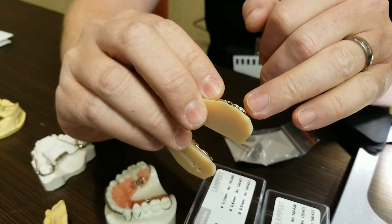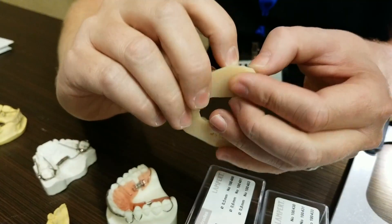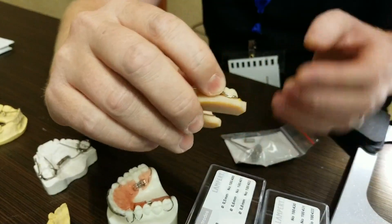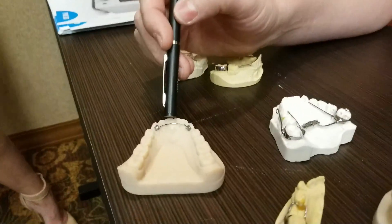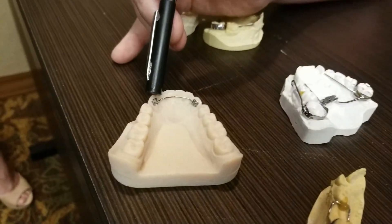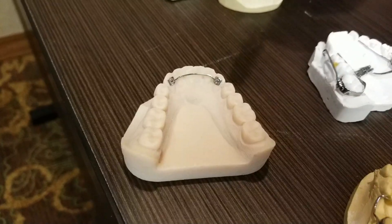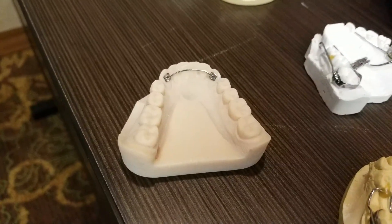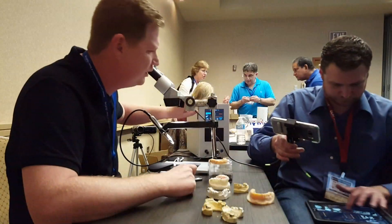On this one I would actually just bump it up to 30% just because it's a 036 wire. Then I start the weld — it welds real easy, just about five millimeters, that's all you need. And then what I did on this one — that's a size 020 stainless steel wire with a mesh pad. Now the mesh pad is really soft, not as hard as the stainless steel wire, so that one I actually just dropped it down to 0.6.